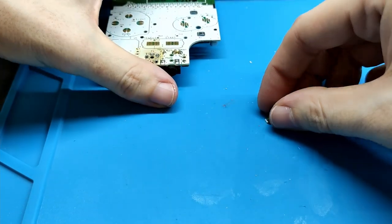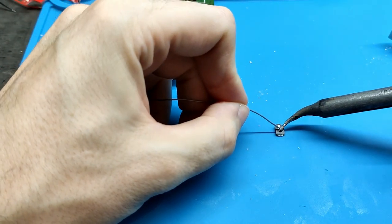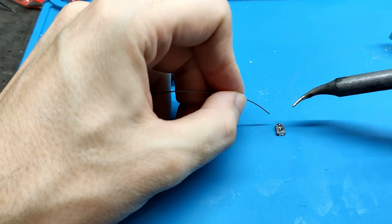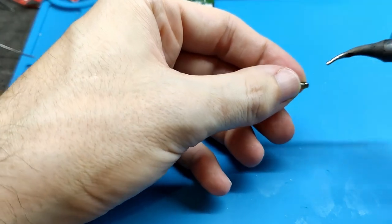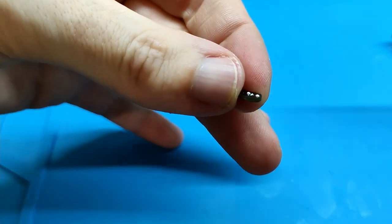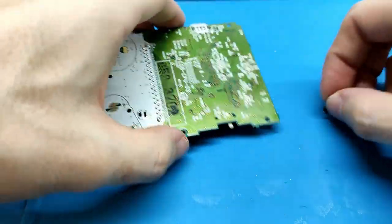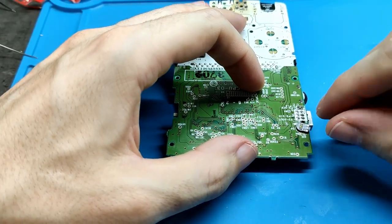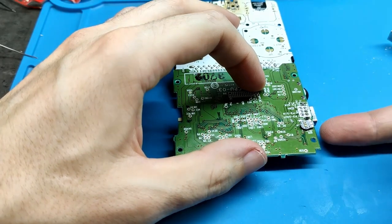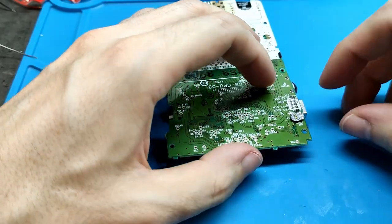The second part, the tricky part, I think more, is solder this tiny board. The way to solder this is first pre-solder these two pads. Let's see, this second has too much, it's only a bit, I don't know if you can see. Okay, pre-solder these two pads. Why? Because now this will help you to center it. You need to put here and apply the solder iron in the other side. But first, you need to be sure you are centering this well.